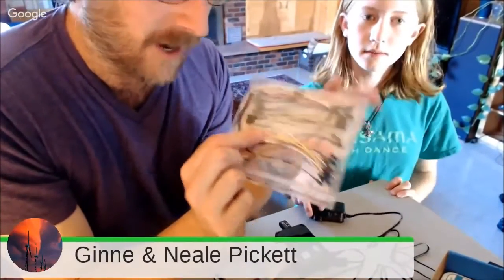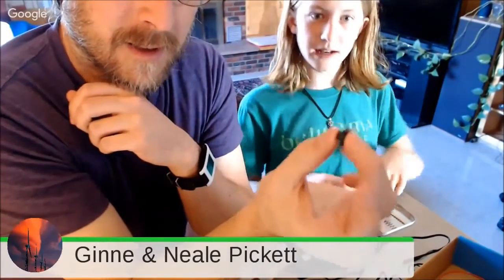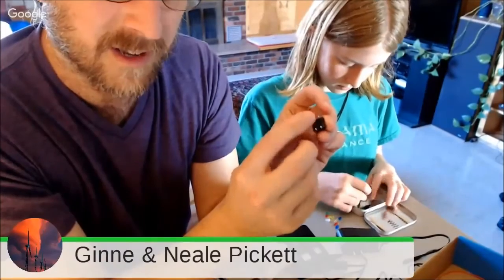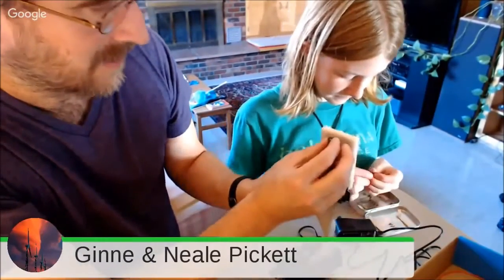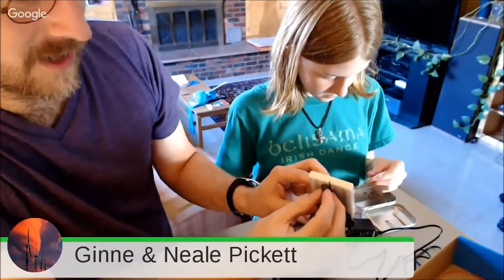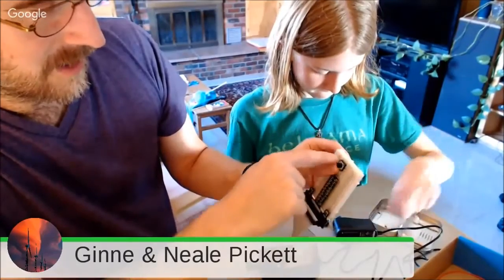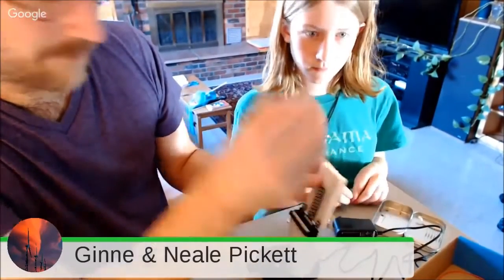There are also these little jumper cables — they're just wires. And this is a button. You'll see it has four connectors that are just the right distance to go across the breadboard. You stick it into your board, then put a cable here and another one there, and when that's connected it means the button is pressed.